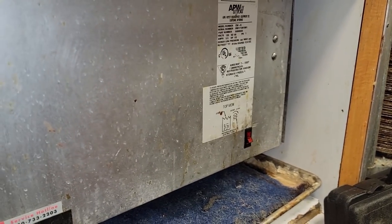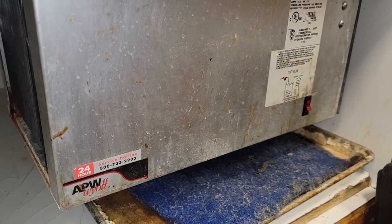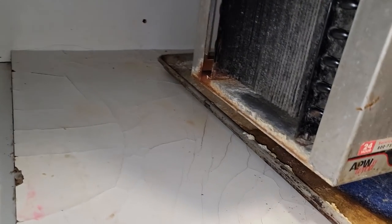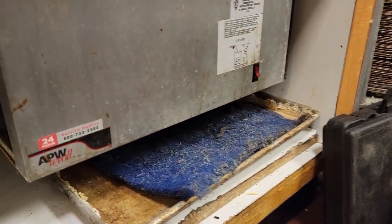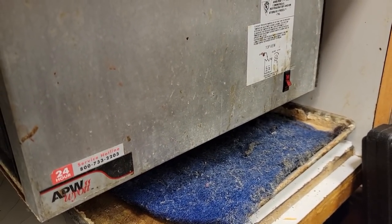So what we're gonna do, we're gonna turn it off. That's gonna let the pressures come up. Then we're gonna go ahead and gauge up on it. The pressures, most likely if it's low, is probably into a negative. So instead of sucking in some extra air or non-condensables, we'll go ahead and get that thing up. And then we'll see if it's low, we'll turn it on, see if it's low. And if it is, we'll probably just pull the refrigerant out, weigh it back in.